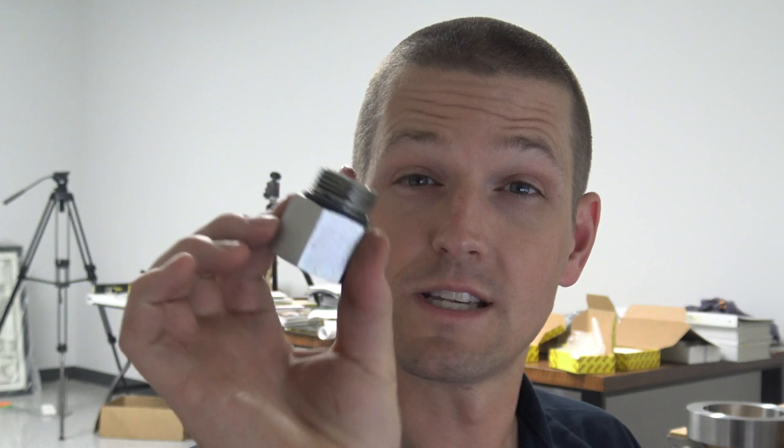Hi folks, we've got a 7-inch turned chunk of 1045 steel, which we've got a thread mill, a big hole in, and it'll accept this, which is a 1 3/16 by 12 thread. Let's give a quick overview of the operations. Let's go make some chips, and at the end, we'll walk through some details on how we did some of the thread milling and other cam operations in Fusion.